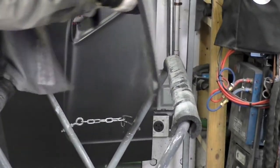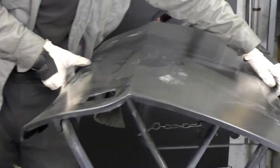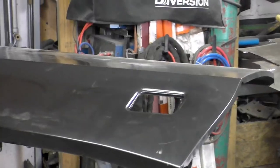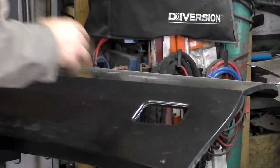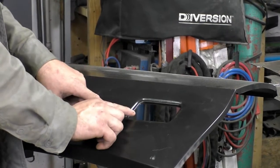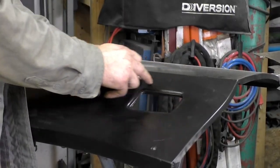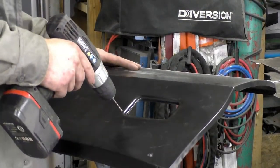All right, flip it back over. Now we're going to prepare this to TIG weld. What I like to do is round my corners — almost like what we have — so when we're TIG welding, and even MIG welding, when you round the corners you don't have an area where heat's building up and it will try to peak up in a point. The more you can curve it, and actually if you made it a circle the better off you would be. We're going to put a little circle in it and I'll show you how we're going to do that.